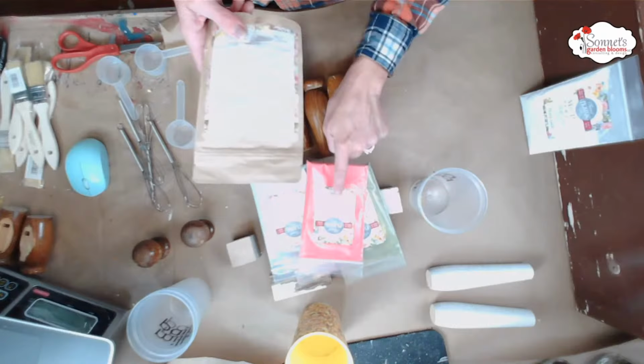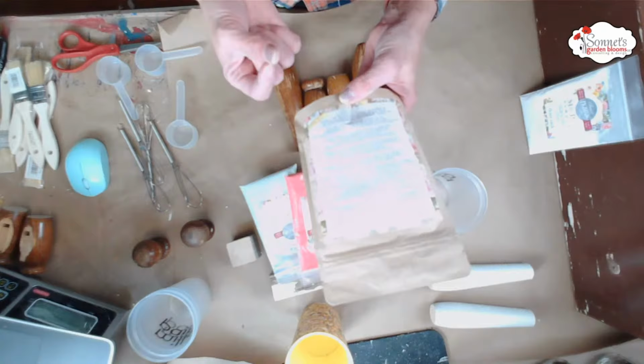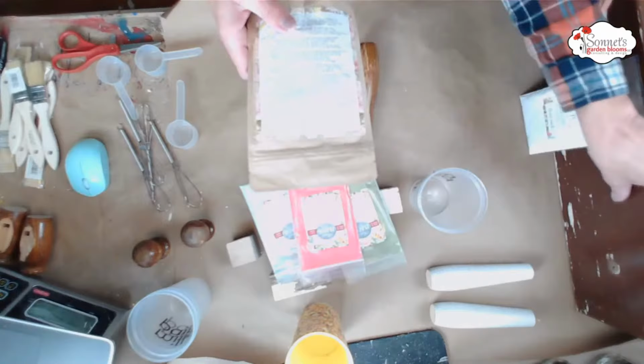So if you need to refer to the samples, but on the bigger bags, which are the pint, you do get the directions on here. So basically it just tells you to thoroughly clean, lightly sand the piece as needed. So we will definitely sand this a bit just because it is kind of like a high gloss. It has a bit of a sheen to it.